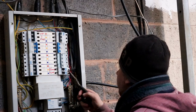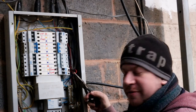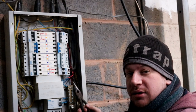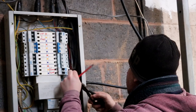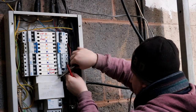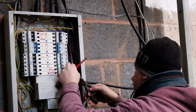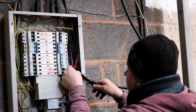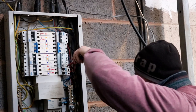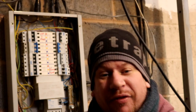There's the other. And the problem is, one of the cables is 2.5mm twin and earth, and the other one is 1.5mm. So the difference between those two is preventing any pressure being put onto the 1.5mm cable. So what I'm going to do is link these two together, and then if these two are then combined wires, when I compress them, they'll combine even more so. Like twisting the strands together almost. And we're gonna grab that. Pop it back in, screw this down nice and tight, power on, and I can see the lights are on upstairs. It's the little things that count.